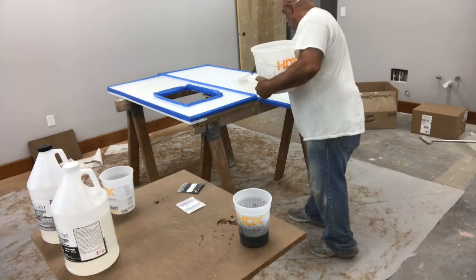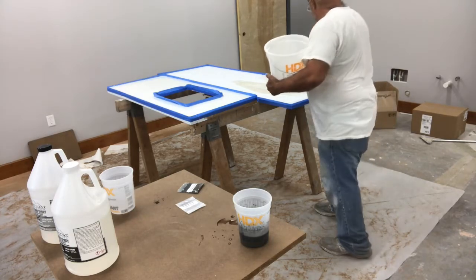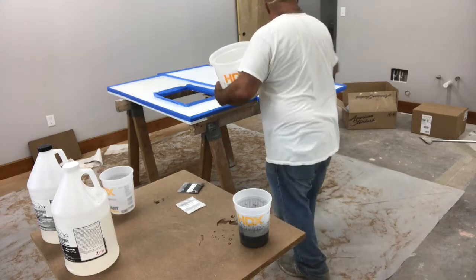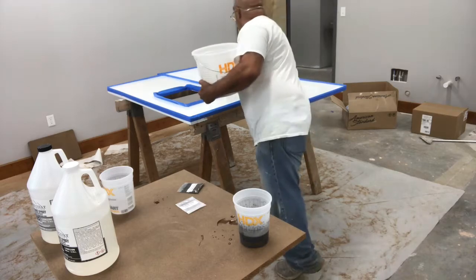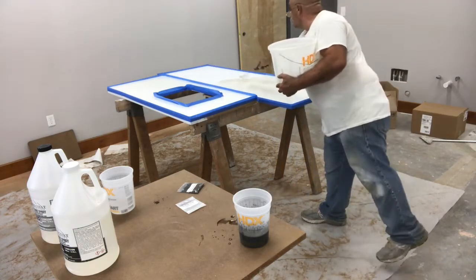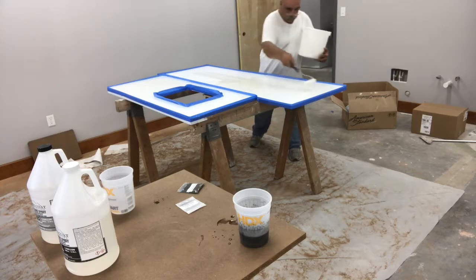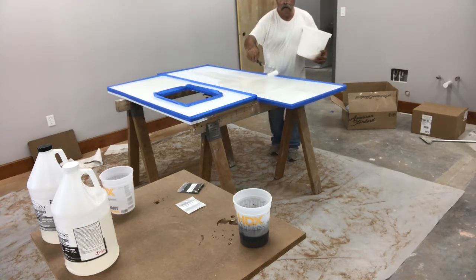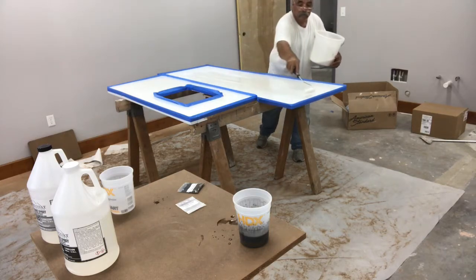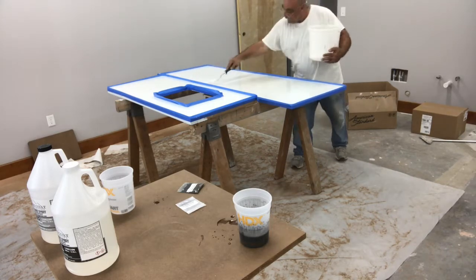Now I'm moving on to the second top, spreading it out and keeping rolling. This is the white metallic I'm putting down first. Just keep spreading it out — if you need more, pour it out. Get everything all the way around. Remember, get it right up to the tape. You're not knocking off the tape, but you want to get that epoxy right up to the edges so that when you pull off the tape, it starts to flow down the edges. It's a lot of work doing a couple at the same time, but they're the same color, so this is what I elected to do.